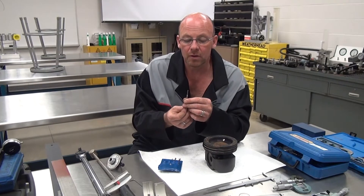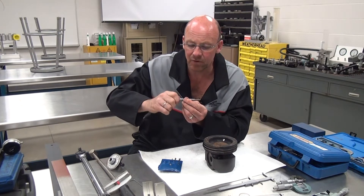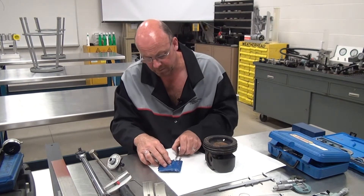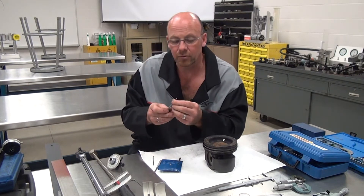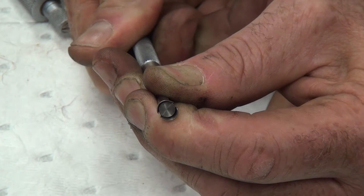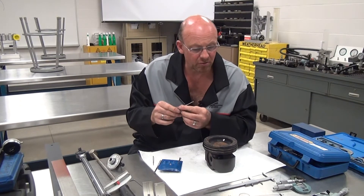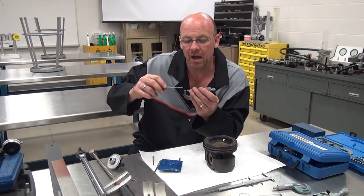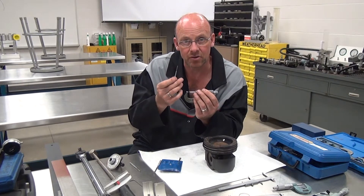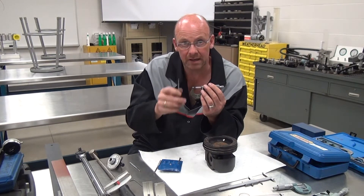You pick the appropriate tool, and then when this tool gets used, it gets put into a hole and then the thimble gets turned to open up the anvil face — you can see how it opens up. That tool helps you go in and pick that dimensional size, and then we would use an outside micrometer to go across the anvils of the small hole gauge to read the actual value.